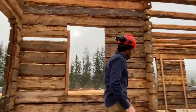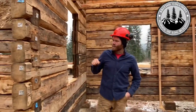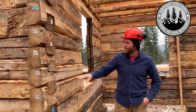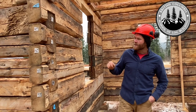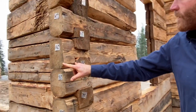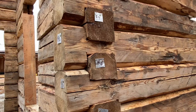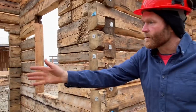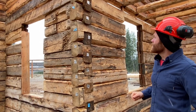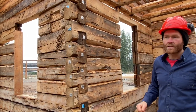Let's take a look at this inside corner. As I mentioned, with the L-shape of the building it makes for a nice feature because we have the exposed ends of the notches shown on the interior. This style of notch is interesting — they've left about three inches of overhang past the edge of the tail. That leads me to believe that this wall was probably longer at one time and this cut was just done during a later renovation, otherwise they most likely would have just done flush-cut tails to match the tails from the exterior.